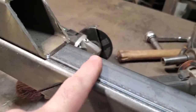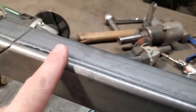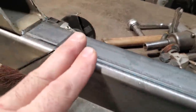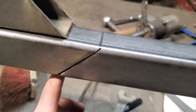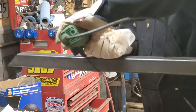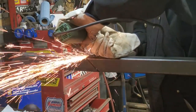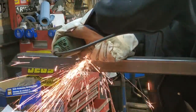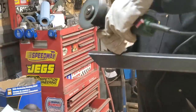And be very careful when you're cutting through it, not to have any weight on this end of it, because this will want to close up your gap, and then of course it will pinch your blade. So I went ahead and I cut it on this side, cut the bottom straight across, and I got one more cut to make. Now I got the three pieces cut out. I got ahead of myself and I said, oh, stop there.